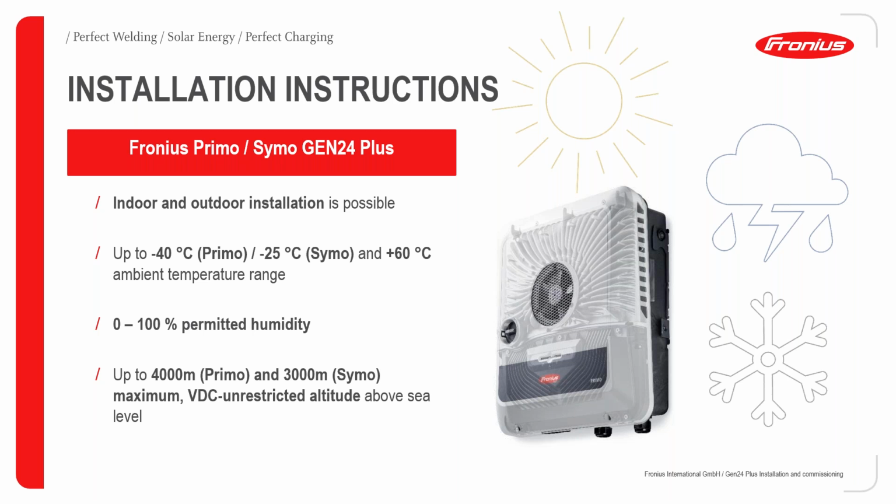For installation instructions, both for the Primo and the Symo, this is a very unique and rugged device that can be installed both indoors and outdoors. It has an ambient temperature range of -40 to +60 degrees centigrade, -40 for the Primo and -25 for the Symo in the lower temperature range, and 60 degrees in the high temperature range. It has a 0 to 100 percent permitted humidity.